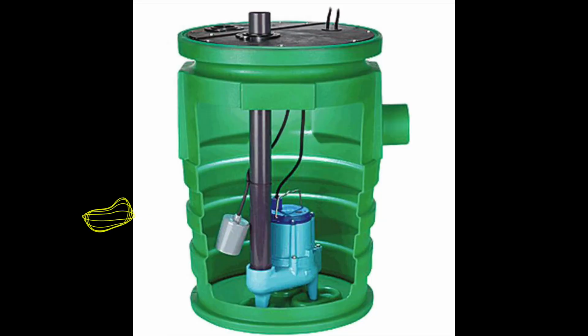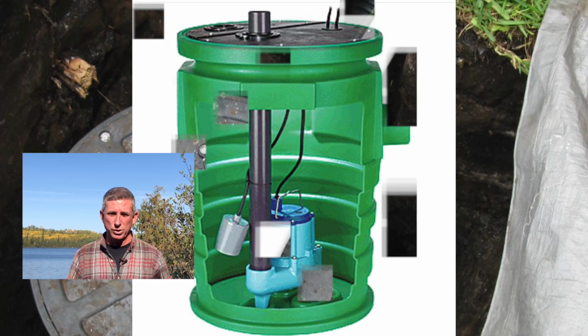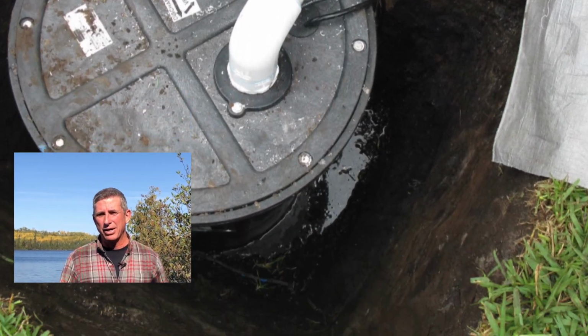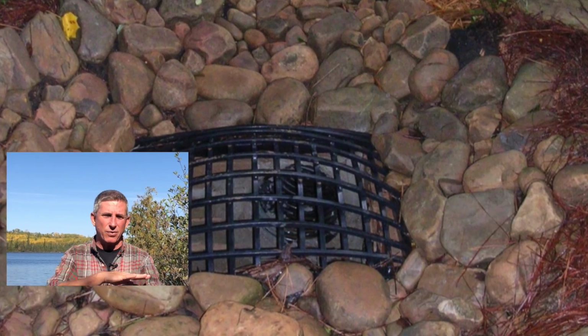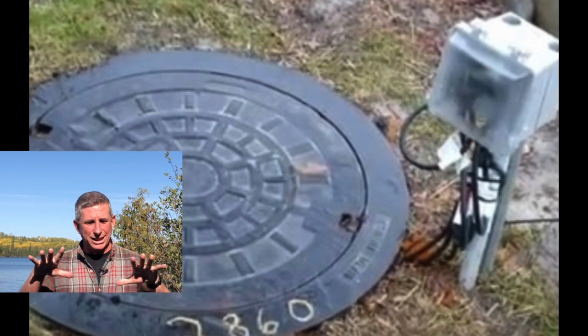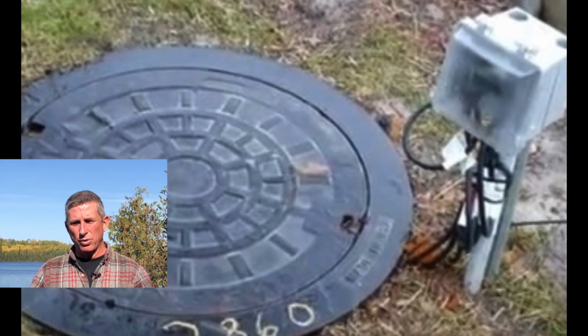Now, digging the basin itself, basins generally stand about 28 to 32 inches, so that's how deep your hole is going to be. You want to have it recessed below grade about 1.5 inches or so, so you can decorate around that sump basin with boulders and gravels or a lid of some kind so that you don't have intrusion.